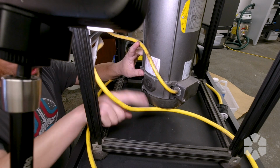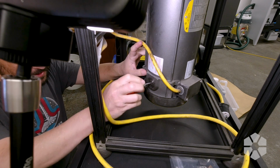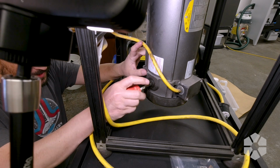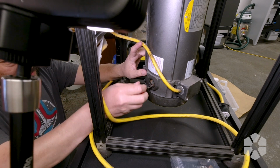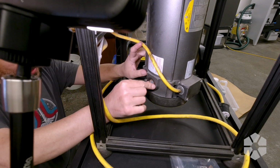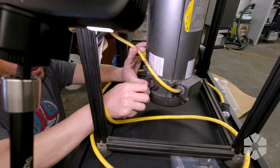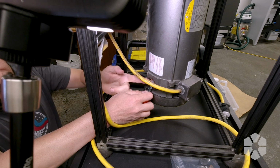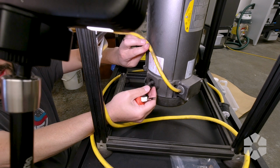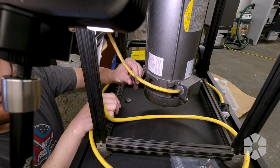Alright, so I've got one brush out already. This is the other brush, just a little quarter turn, half turn, and a couple of turns. This should pop out. Normally that pops out harder when the brush is longer. So I don't know, we might have gotten so short that we lost contact. Oh, one step forward. There we go. So the brush just comes out of this little slot. This one's actually less bad, but I think we definitely have some issues.